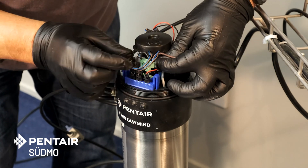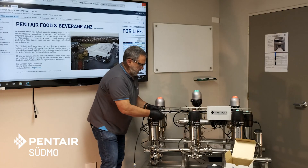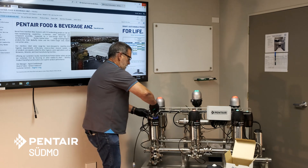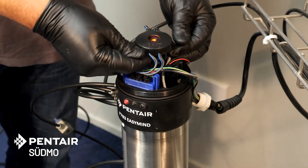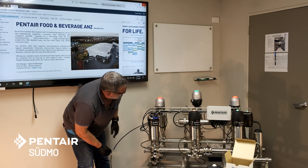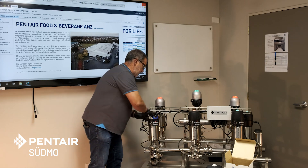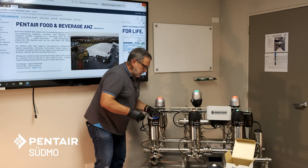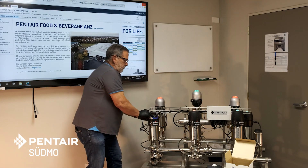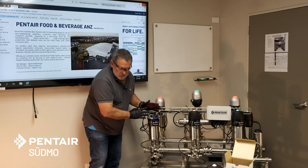What's important is routing these cables away from any moving parts inside here — that's what these little slots in the back of the switch mounts are for. Route the control cable and fit the high-vis unit in place — just drop that down. Take the air out now, we don't need it for now. Check the routing of these cables are clear of the threads of the control cap, because the control cap threads will cut them. That's in place, everything's working, switches are all right.